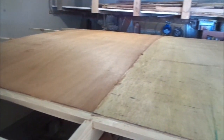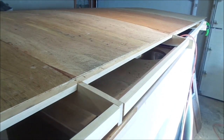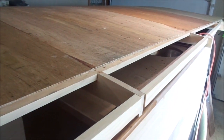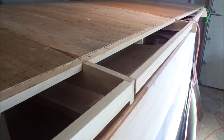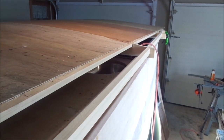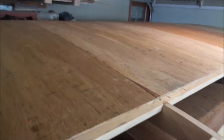I have all the door skins on the main part of the canopy. The part I have to finish now is some small pieces that will come right out to the peripheral of the canopy. After I add the door skins to the outer peripheral, I'll use my belt sander to shape along the edge and make it nice and curved. Then I'll add some cedar trim to the outside, sand it, and prep the top for glassing.